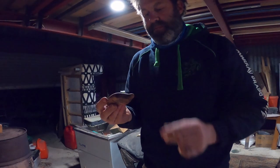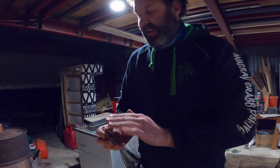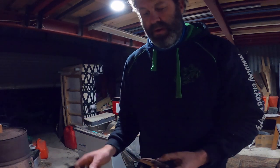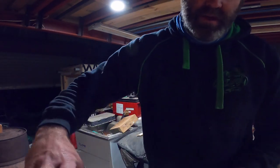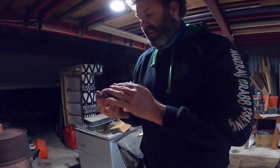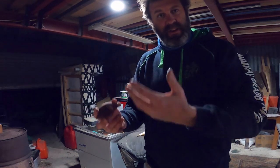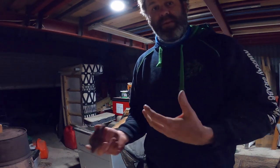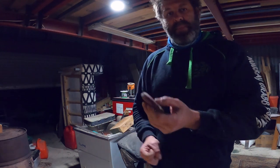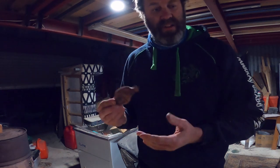Right, sealing the lure. For those who don't know, it's waterproofing the wood, waterproofing the timber, so that if you get scratches in your clear coat and your paint, your lure doesn't just swell and get ruined. So we're using polyurethane. It's watered down a little bit, but it still works really well in a vacuum chamber. What that will do is it'll be submersed. The vacuum will actually suck any air out because air offers the least resistance, so it's the first thing to be vacuumed out. And the hollows in the wood can't have nothing in them when the air's sucked out, so polyurethane is sucked in and it waterproofs and hardens the wood.